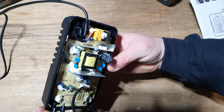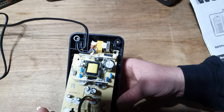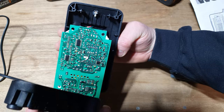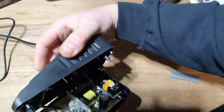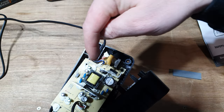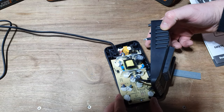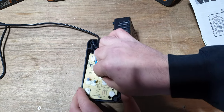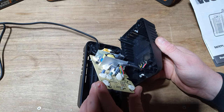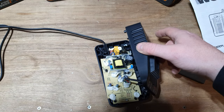And then you've still got the absolutely nightmarishly large capacitor — a 68 microfarad 400-volt capacitor — which I am not touching anywhere near, because like I said they give really bad shocks. I don't really want to have to go see a heart doctor to explain myself. And then obviously you've got the chipset there. The chipset that does the identification I believe is tucked underneath there — that's the chip that does the handshake protocol. It's also worth noting this has got a Molex-style connector that does unplug, and some very baby little 10 microfarad capacitors at only 5 volts. I can almost lick one of those!